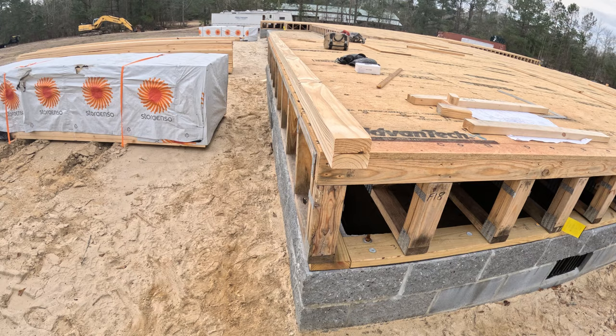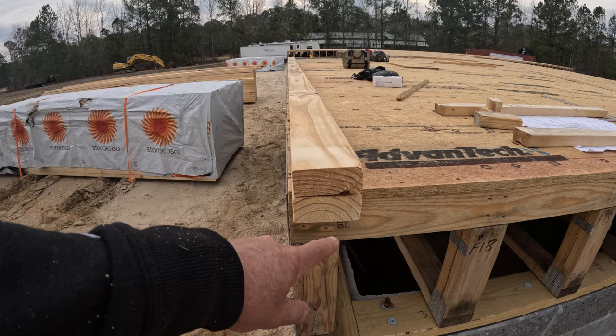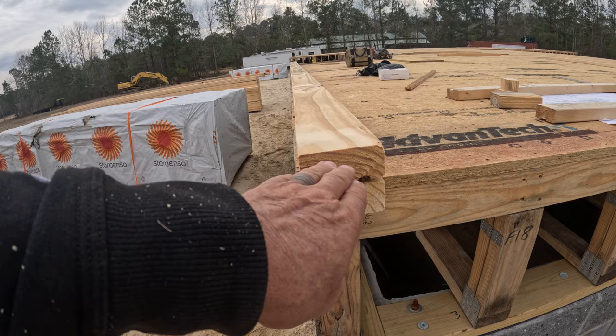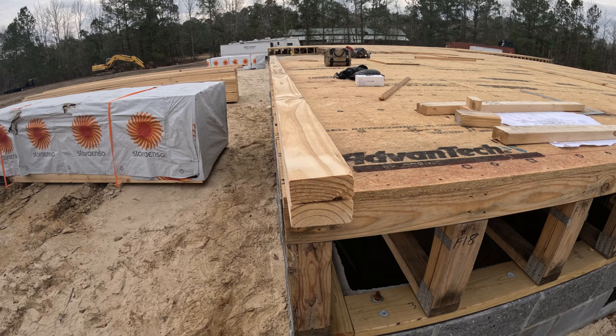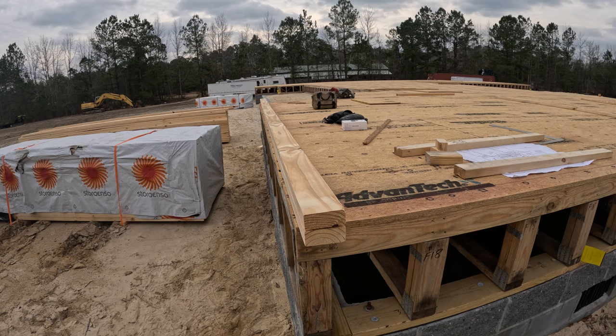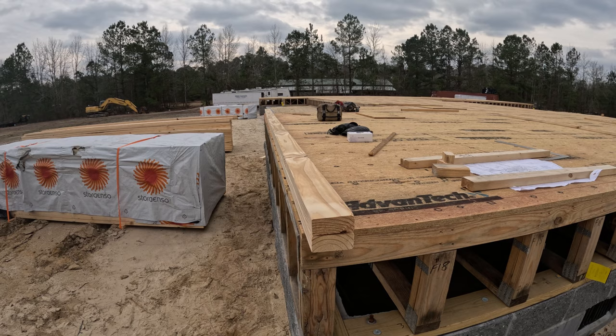And so when I'm actually laying them out, what I do is I look at the growth rings. And you really should have them be like an arch. So if you see that rainbow-looking pattern, this one doesn't really have too much, but it kind of does. What'll happen if you do it the other way, and it won't matter as much on a wall, is that it'll tend to want to cup, and sometimes it actually has a little depression on the underside. So if you turn it the other way, it'll collect water if it's something you're doing outside where it's going to get wet.